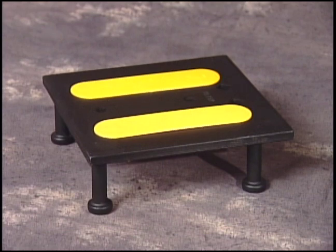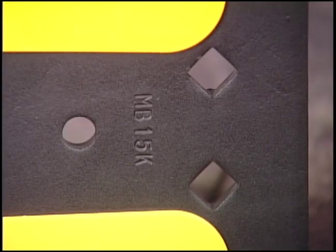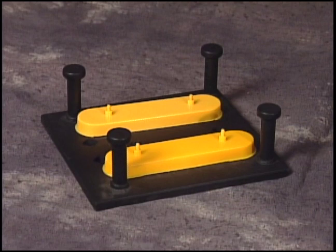The MB RapidLock is loaded with features, such as the annealed super studs for increased strength and the new diamond holes to make it easier to align and locate the bearing point. In addition, new and improved foam-filled block-outs have been added to prevent intrusion of concrete into the void during concrete placement. The MB RapidLock system is ideal for use in buildings requiring 1- and 2-hour fire ratings, requiring long-term durability and corrosion resistance.